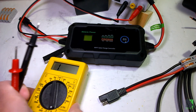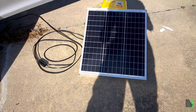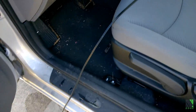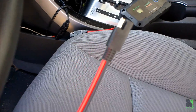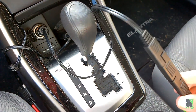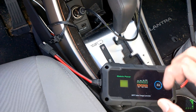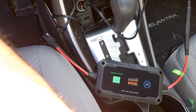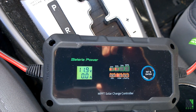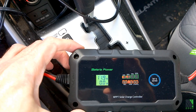To connect the battery for the first experiment I have a different cable I'm going to use. I've got a 50-watt solar panel and my charging cable running into my car. There's the charge controller. I'm using my own 12-volt cigarette plug adapter to SAE with the polarity reverser they provided. I'll switch on the car's accessory port and then connect the solar panel. I've set it to AGM for now — that'll be enough.